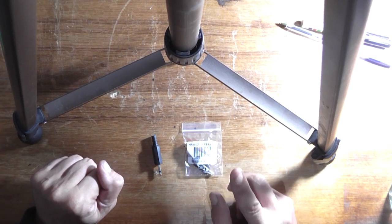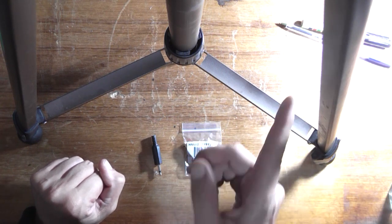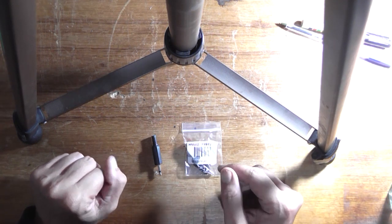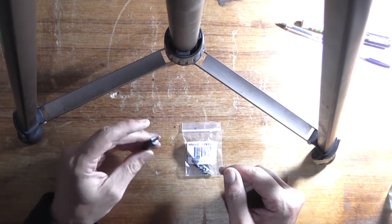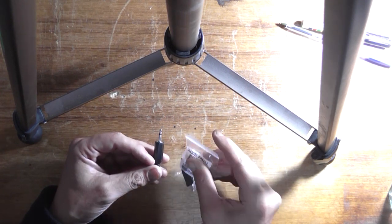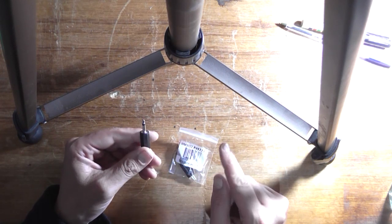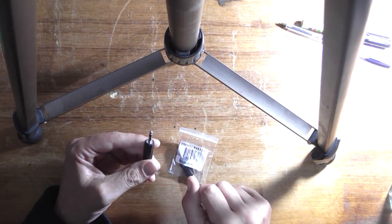Now, I want to test that ESP preamp by pumping it into my interface just out of shot there, but I can't because I've got no way of connecting it. So I'm going to make a small little cable with clip leads on the end of it, just using two pieces of hookup wire, just so I can get the output signal to go into the interface.